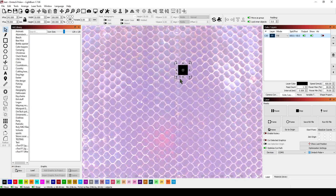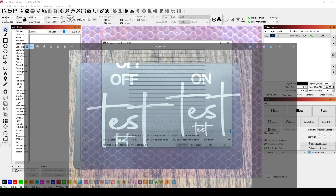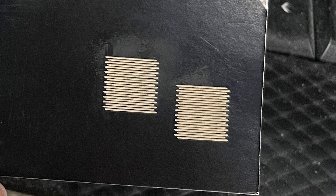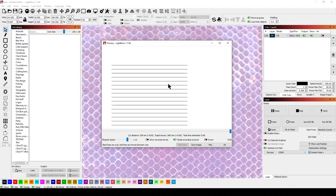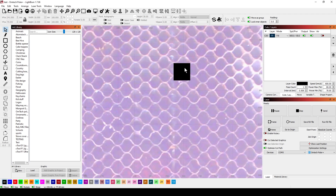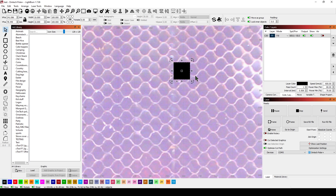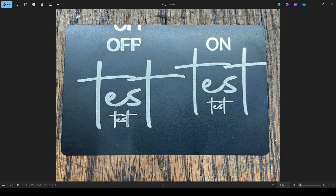Setting to 50 LPI means when it sends to the laser, the lines are going to be so far apart that you'll actually be able to see the offset. You want the lines to look perfectly flat — you don't want them going up and down. You want them straight across. More than likely it won't be that way unless you've already adjusted this. From the cheapest machine to the most expensive, I've heard of people having to adjust this. It's basically the latency of the system. Once you get this set, you should be good. If you're running really slowly you may never notice it.